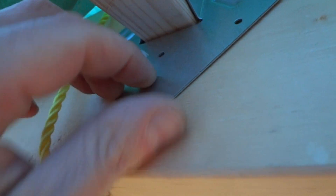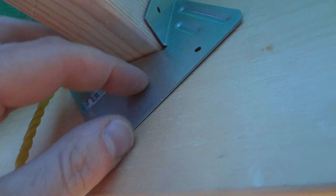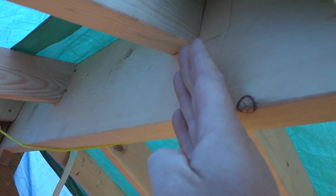This will take a lot more work to nail or screw, and if you nail it you won't be able to take it apart if you have to move your shed — that's why I'm using screws instead. This gives a very rigid fit — you can't move it at all. I might also put a two-by-four going across from one end to the other to support it, or maybe put a hurricane tie right here.